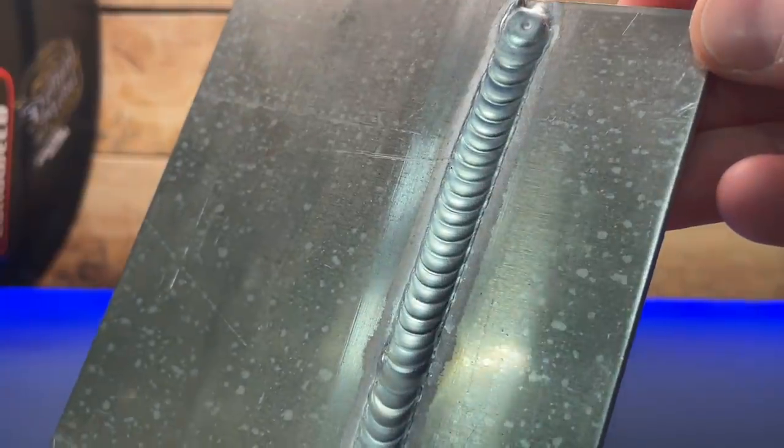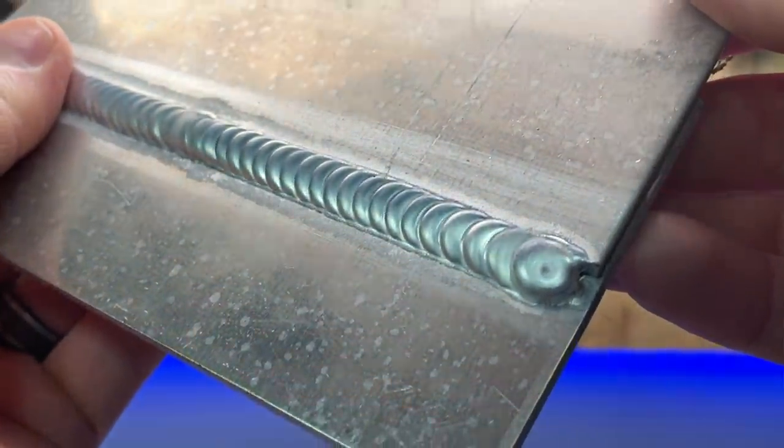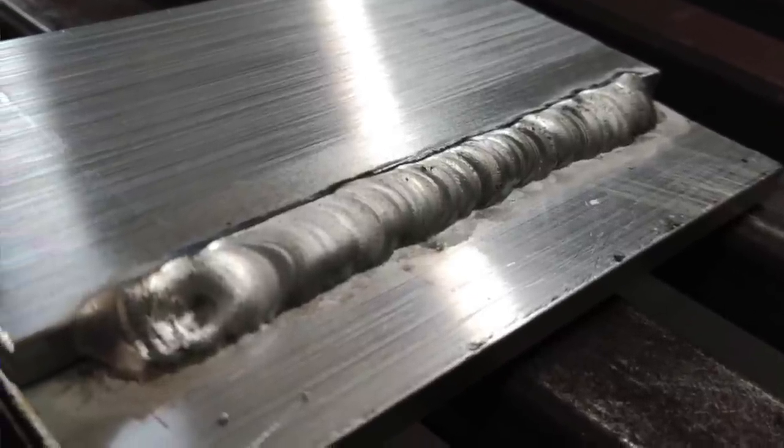The last thing we can take a look at is your overall appearance. What does it look like? Is it shiny? Does it become dull or a little bit chalky as we approach the end of the plate? These are features that are going to tell you how you did as far as your heat input goes. If things look shiny whereas towards the end of the pass they start to look cloudy and dull, looking at details like this are going to help you break down how you did as far as your overall heat input and heat control. These details are really important, not only to practice while you're welding, but especially after you finish welding. There's a lot of work that comes after you finish a weld, and a lot of these things usually go unnoticed by a lot of students.